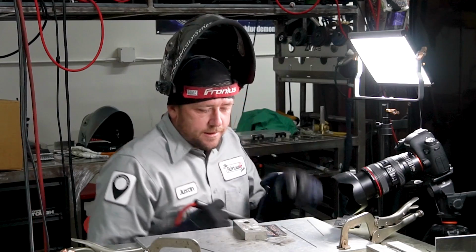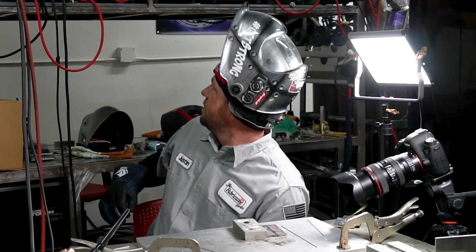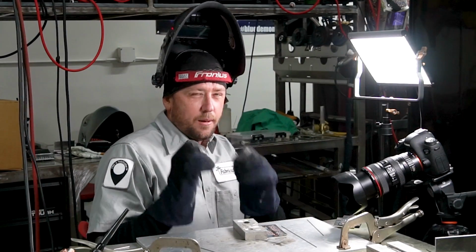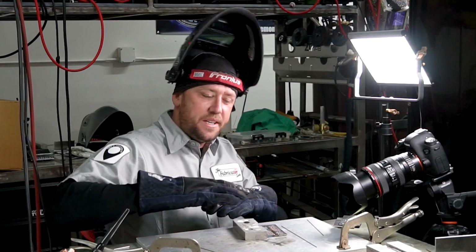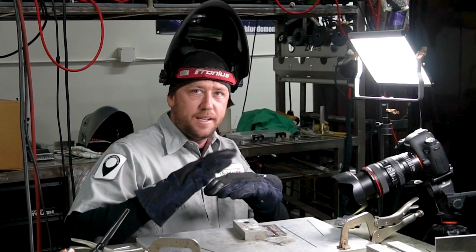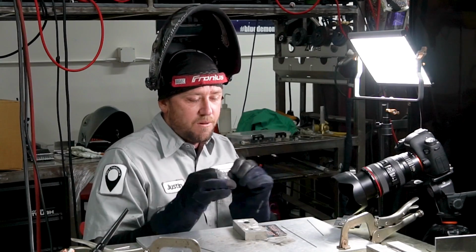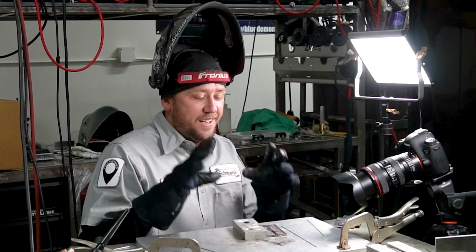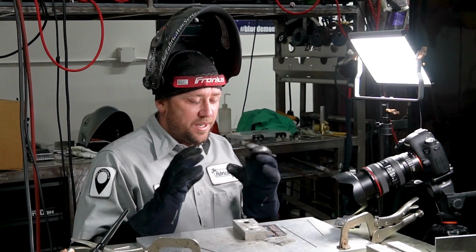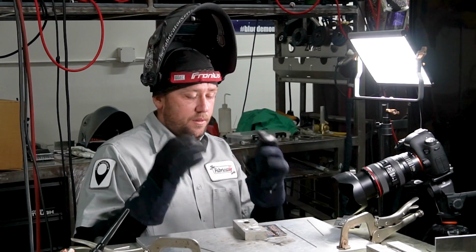Okay, I got that just a teeny tiny bit hot maybe. The machine is currently set to about 75 amps, and I'm just working that as I need it. Like I mentioned before, with the pedal, when we need more, we need less, wherever it is. We don't have an exact number of where the machine is going to run. All I'm doing is connecting my eyes with my foot, which controls the torch, right? As weird as that sounds, that's all we're really doing. What we see in front of us is what we use for our weld.